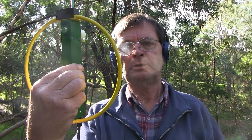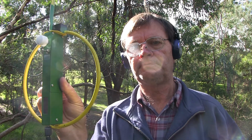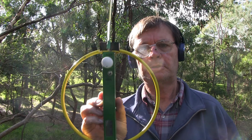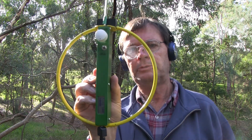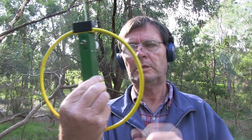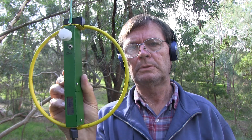Coming right round, we've got a nice null around the other side. The peak is on this side, the null on the other. We can adjust how strong we want this whoopee mode. It's also got auto-attenuation on the receiver — as you come in closer to the transmitter it attenuates itself. I just bumped it up and it automatically attenuated back down. You can hear those little bells ringing — that's just attenuated as we came around because the signal was stronger.